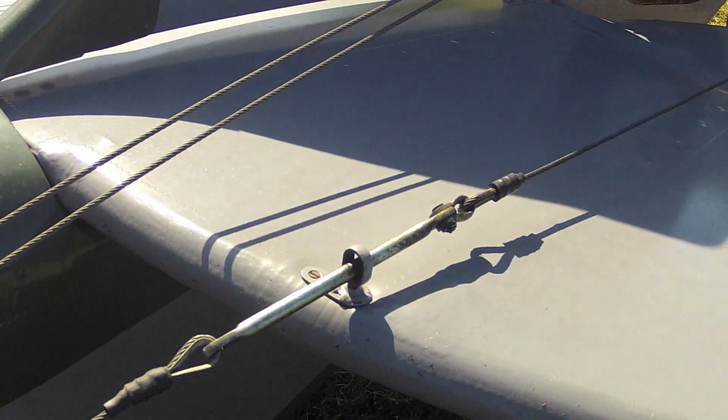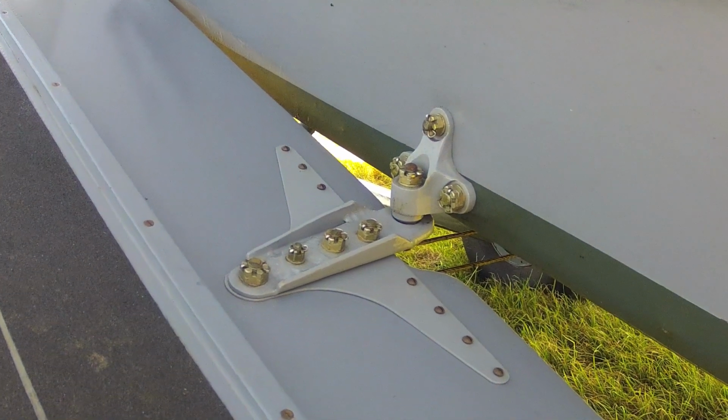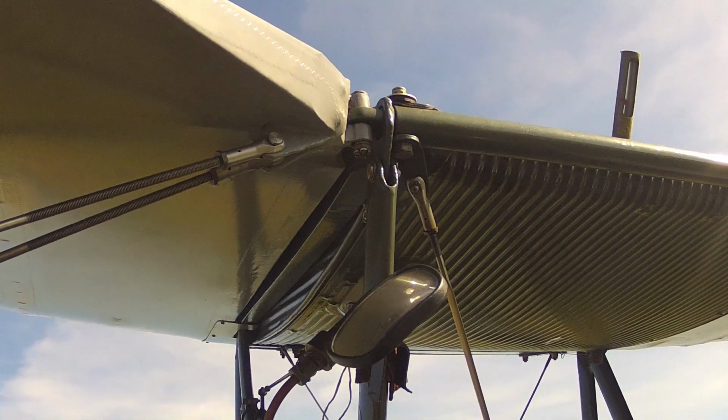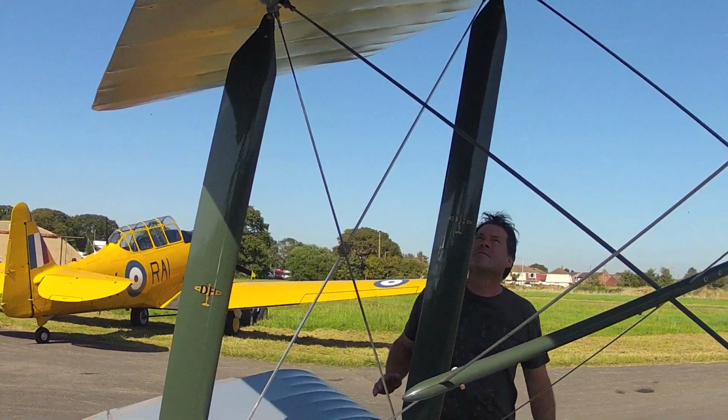Remember also to get down under the aircraft and have a good look at the fittings through which the controls run. Make sure the main wing attachments are secure, and also have a good look at things like the wires and centre section. Any slack in a flying wire should be investigated as it shows structural damage.